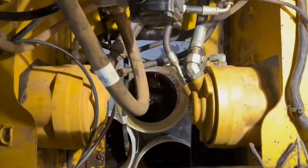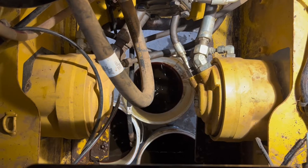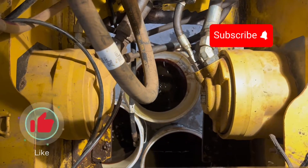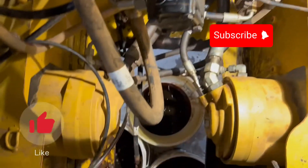Mine was just as simple as removing the cap and letting it drain. This machine has 13 gallons of fluid in there, hence the three buckets — I'm just able to piddle around at the rest of the machine as it drains. That is how you drain the hydraulic fluid out of the skid steer: raise up your cab, relieve all hydraulic pressure, take the cap off the reservoir to allow breather space, and let her drain.